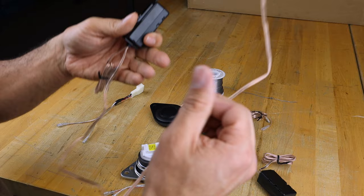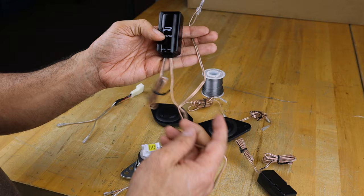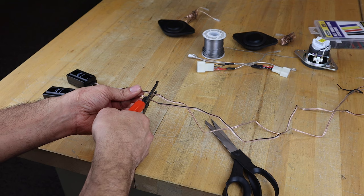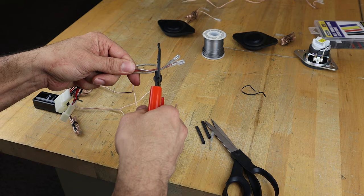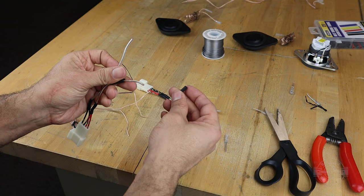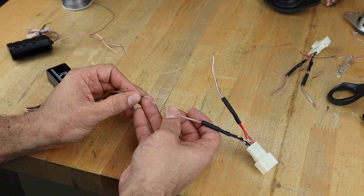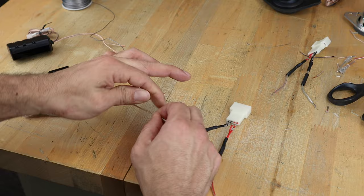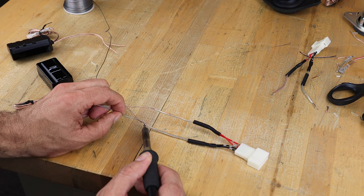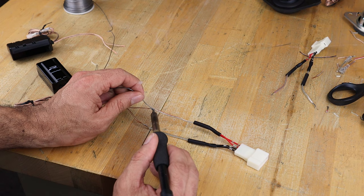I'm going to take the adapter that I bought and solder it to the input terminal. I'll cut it to the desired length so I don't have all this excess cable, using a very simple inline splice that anyone can easily learn. First I'll cut the cable to my desired length making sure I leave enough wire to work with, and I'm also cutting the ends off the adapters. I'm using heat shrink tubing — after sliding the shrink tubing I'll strip about half an inch of insulation off the ends. To do the inline splice, simply intertwine the strands of the cable together. Make sure you pay attention to polarity — a cable with a black stripe usually means it's the negative cable, so check that twice. Use a soldering iron to heat up the exposed wires and melt the solder onto it. Once that's done, use a heat gun to shrink the tubing over the splice and you're good to go.